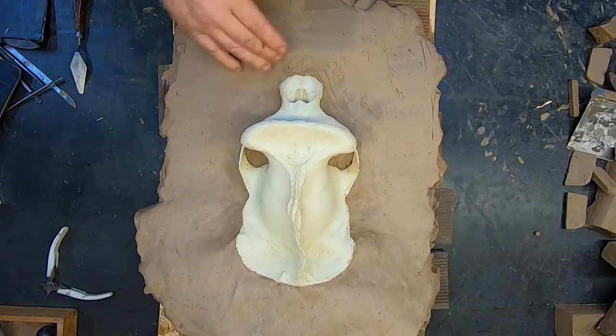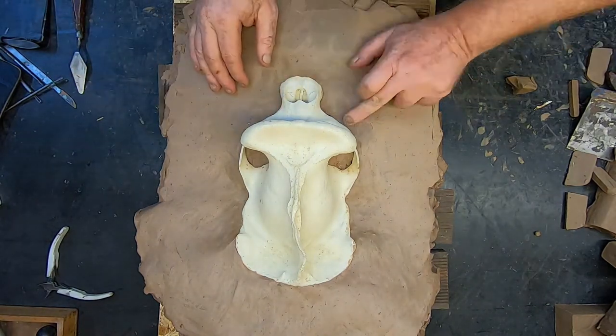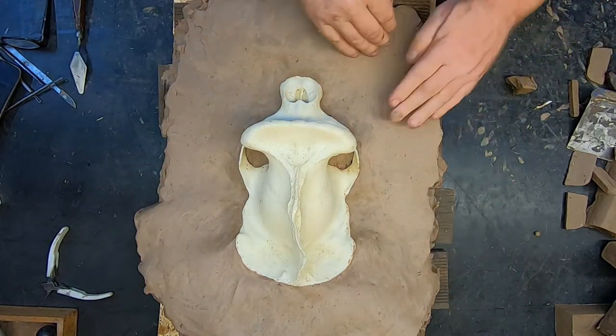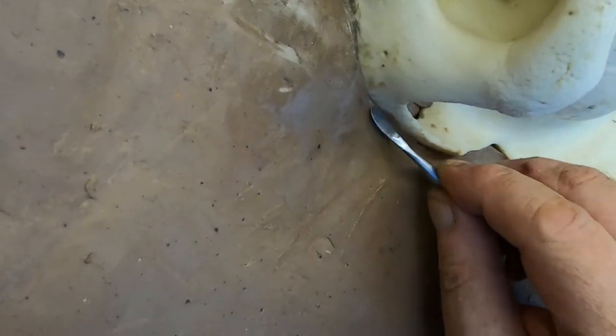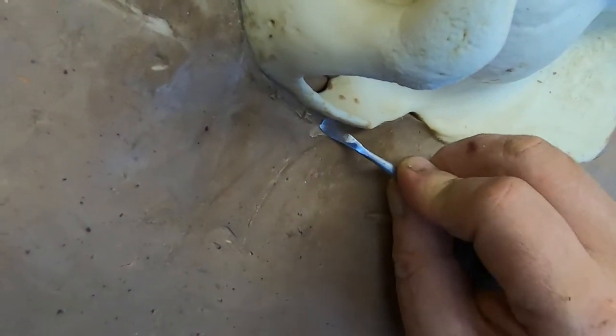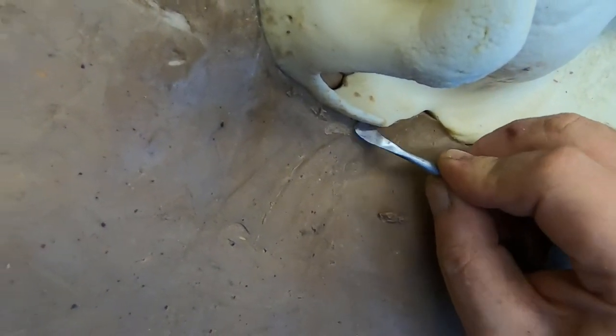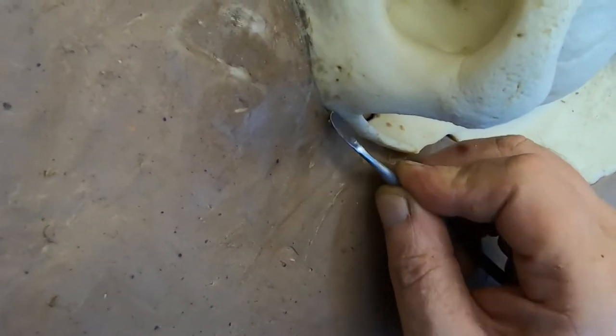When you have a rough bed all the way around, you can now move closer to the object by making small sausages of clay and pressing them lightly against the object. Very important, the clay should be as close to 90 degrees to the object as possible. Use a sculpting tool to achieve this. The better you do this, the better the casting will be later.